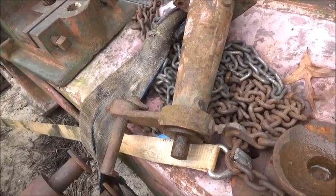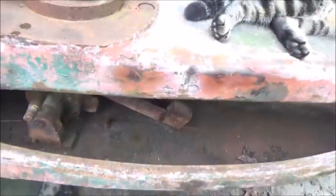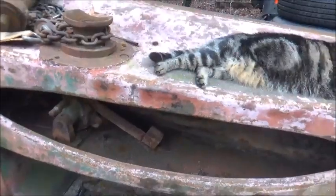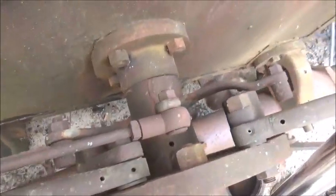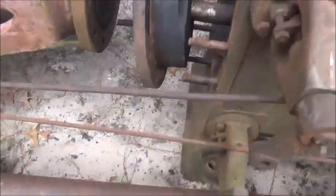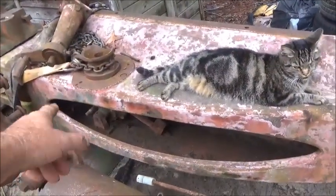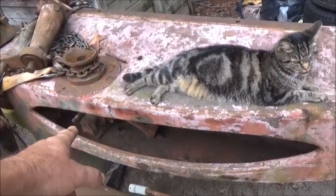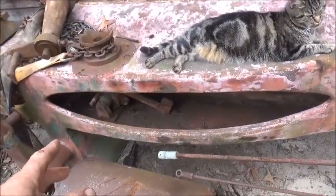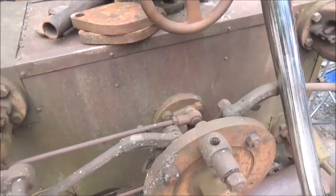That was a missing piece. The automatic shutoff is down here — this is sort of different from all the others also. We're going to be learning everything as we do all this valve gear. These rods — depending on where the governor's at, these two rods hook into the safety piece and there's a rod that runs up from the governor down to the safety shutoff. I'm assuming these are limiting rods — they actually limit the amount of steam it can go in through the throw on the valve.